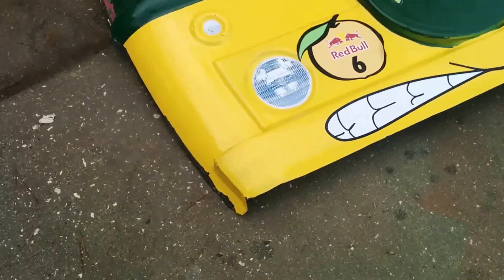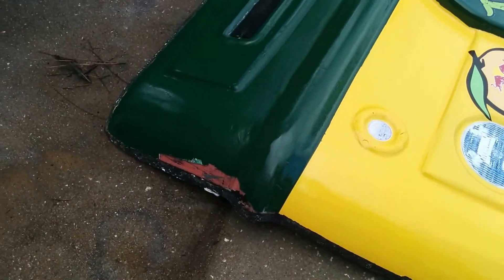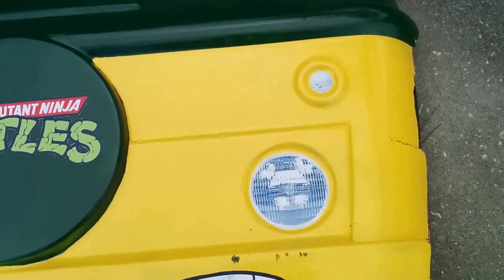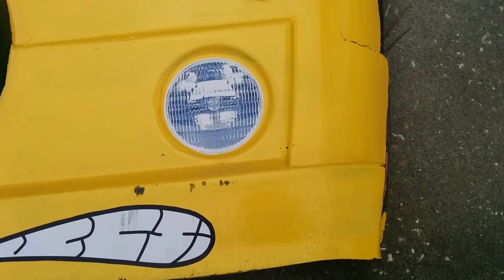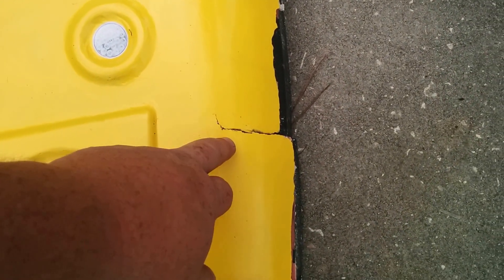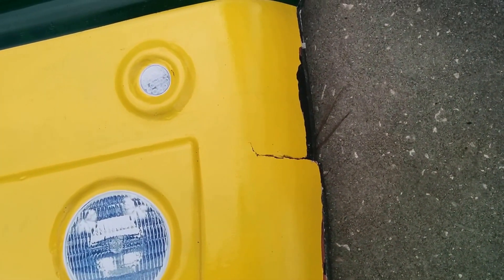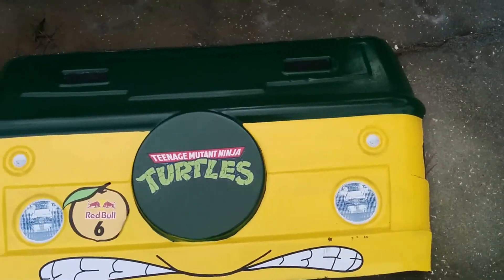That's not bad — actually that's probably the best case scenario. You can see the front end right at the joggle point, it delaminated. Nothing too bad; we can go and fix that. We did have a little bit of a hit right here where it went past. Overall, it looks like there was a small crack that did propagate, but I think there was a crack already here — that crack just grew. Overall, the front end looks very good.